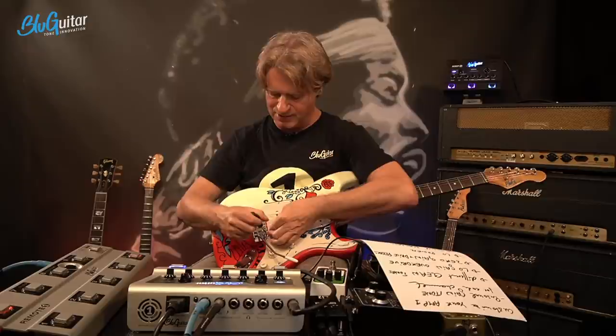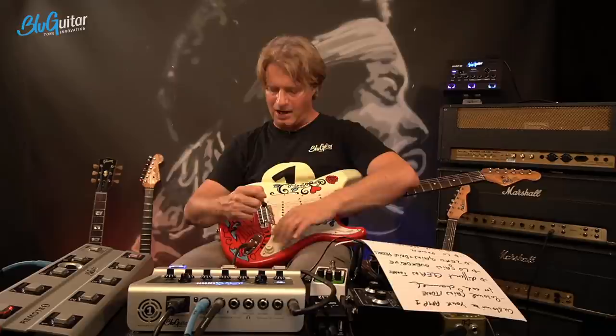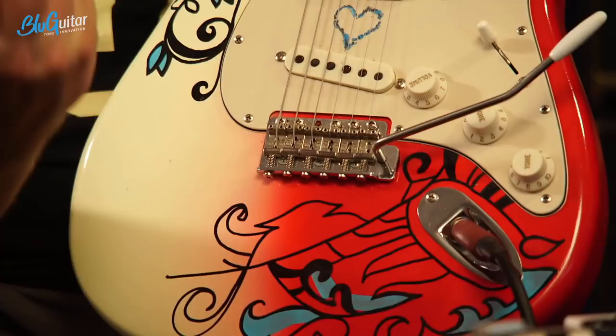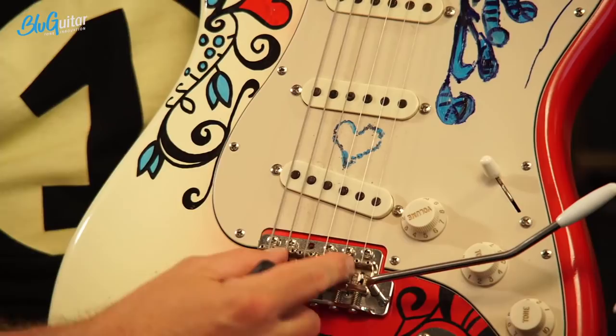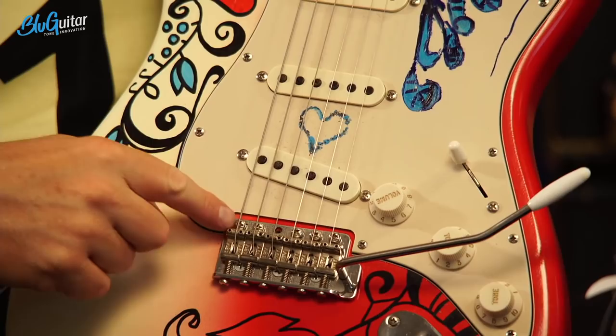And the same I do for the other outer screw. The middle screws here, I have them all higher. So the whole guidance comes from the outer screws, and the screws in the middle are only there to have some more guidance, but not in the height. The height is only done by the outer screws. The middle screws are higher, so they only do that.